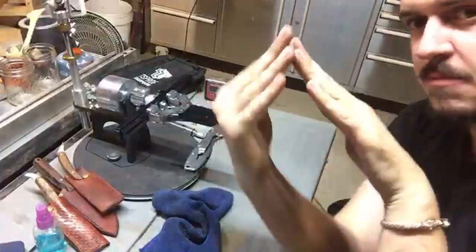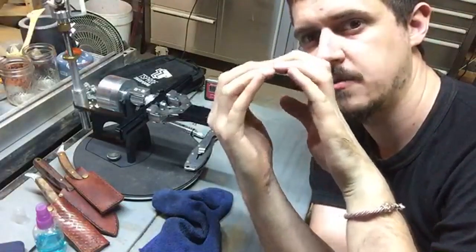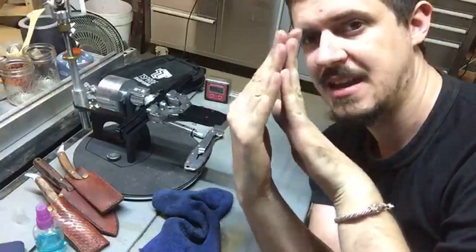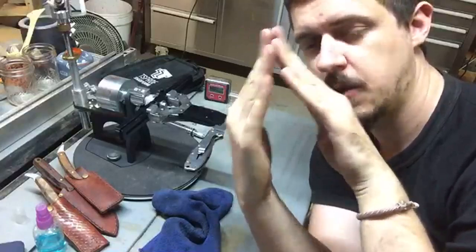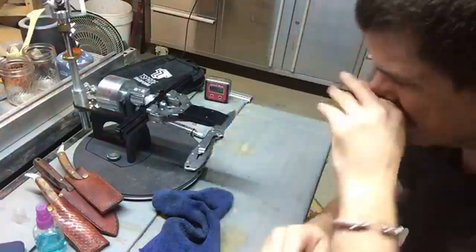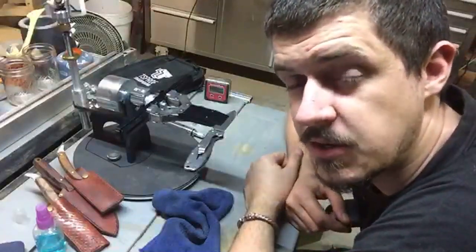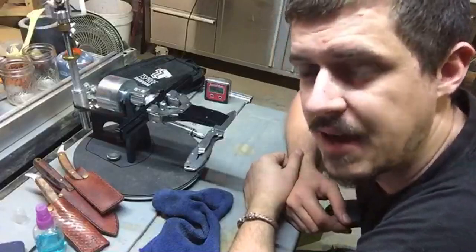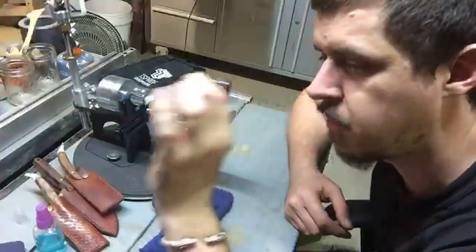It's essentially shaping it into that nice even pyramid. Not a pyramid with a flat top, and not sort of canted to either side. You want a nice even pyramid. And that apexing with a 180 grit stone, I've seen people be able to get blades that are sharp enough to shave at a 180 grit stone simply because they have apexed it to perfection, to an absolute peak point.